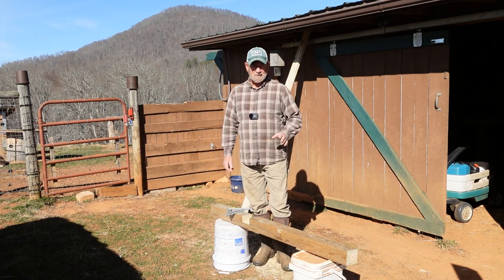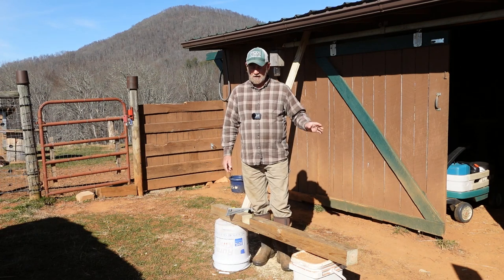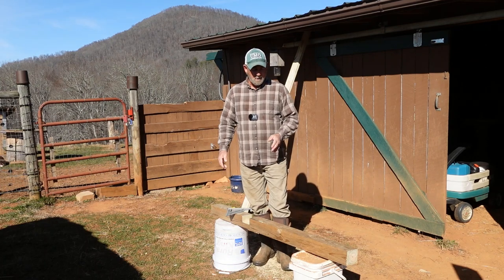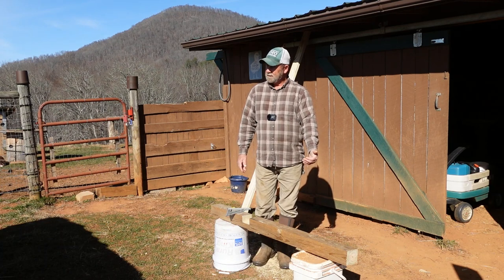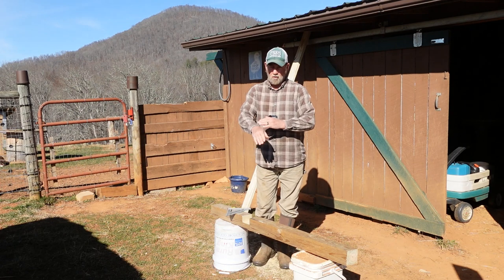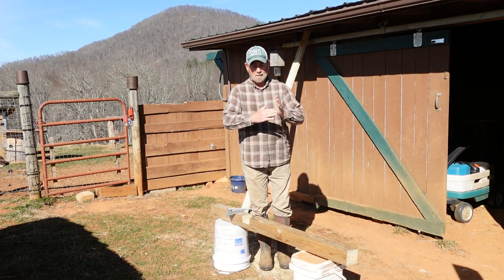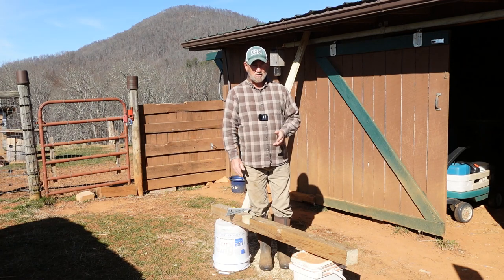I didn't realize that till the goats fed out of it for a while, and I could sit and watch them, and I cut those windows too big. So this one, I'm gonna cut the windows more narrow, and I'm gonna put an additional support leg under the barrel support arm. And it's not really to support the barrel, it's to support where the base is, to keep the back from wanting to pull loose from the base, even though we had a bunch of screws in it.